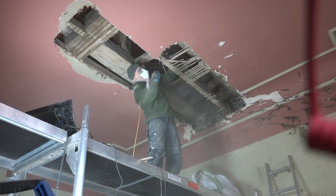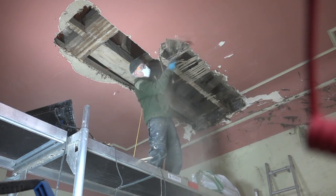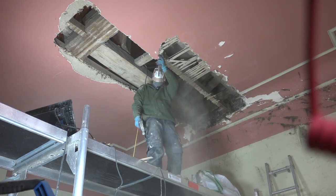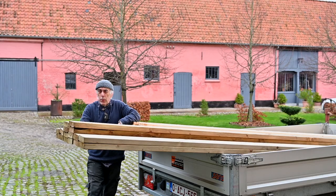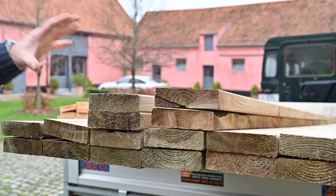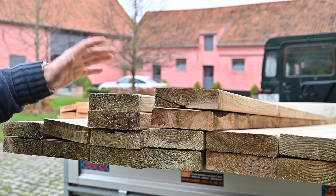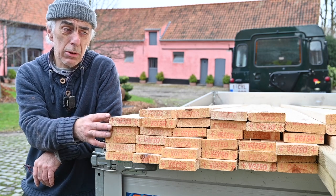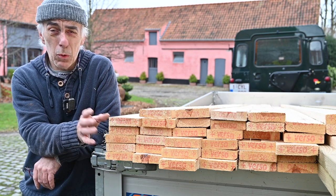Still, I'd like to reinforce it a bit. At the time I postponed it because I wanted to have the ceiling done first, and now we can actually do that. I'm going to put up additional rafters onto the roof to reinforce it, and then insulate the ceiling or the floor — no matter which way you want to call it. Here's all the wood that we now need to drag up to the attic. I'll use treated pine on the floor, and for the vertical and horizontal rafters I'm going to use untreated pine — it will certainly last my lifetime.